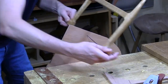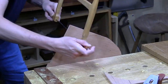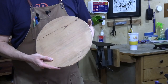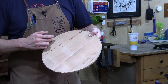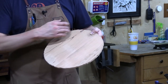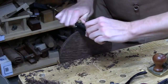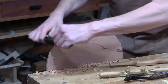Grab your turning saw or coping saw and saw out both the wenge and the cherry circle close to the line — as close as you can — then follow up with a spokeshave to bring it right back to the line. The closer and more consistent your saw cut, the faster the spokeshave work goes. The circles don't have to be perfect, but you want them to look like circles. Pay attention to grain direction as you work around — the grain reverses on you several times, so you work in four different sections around the circle. Keep the spokeshave setting light and you'll see when the grain starts to reverse.